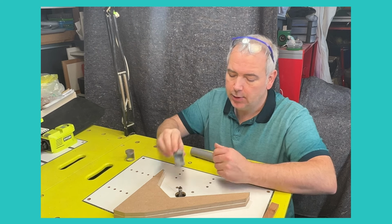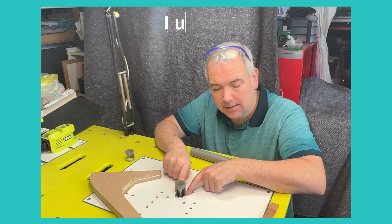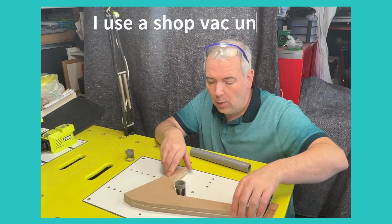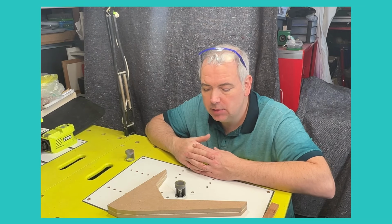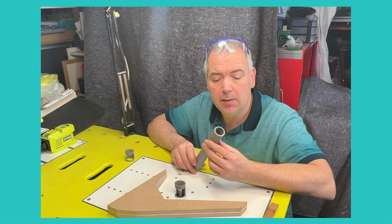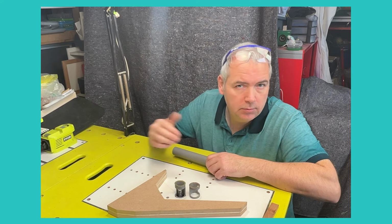Well, if you put this little piece in like so, as it spins your machine, the dust goes to the back and gets extracted. And the mouth is open enough that you can do quite open and angular cuts without compromising the dust extraction system that you're using. And all I did was make it out of some PVC pipe. I did different ones for different sizes of holes, for small, large, and medium, etc.